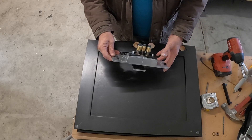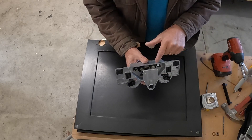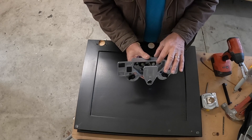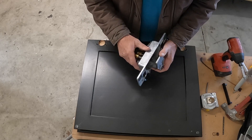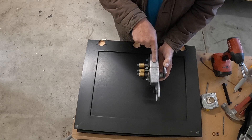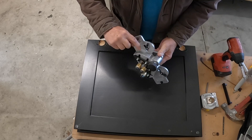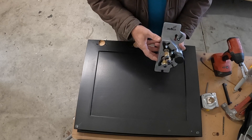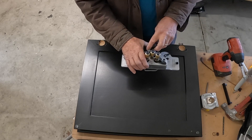One thing I do not like about it is there is no room for the shavings to escape. So what I'm going to do before I start all of them is set this in the mill and run a pocket right here so at least some of the shavings can come out. I'm thinking about doing one here and one here — it's not going to change the integrity of the jig or any of the adjustments.